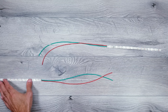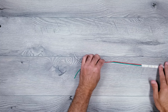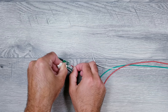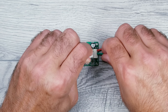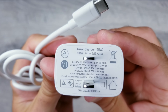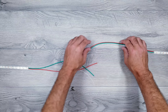Next we have to choose a controller. I created a mock-up of what I have in my garage to make it easier to follow along — we'll pretend this is the LED strip on the left side and this is on the right. If you just have one garage door, you can make this as minimal as possible and use the MAG WLED controller. Just make sure to have the switch flipped to the 12V side. I'll remove the JST connector it comes with, strip back the wires soldered onto my LED strip, and get them connected to the board. The beauty of these 12V SK6812 lights is that you can easily power close to 10 meters with a simple USB-C power adapter that puts out 12 volts and 3 amps.